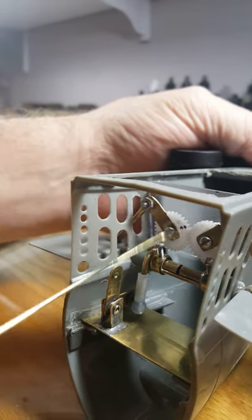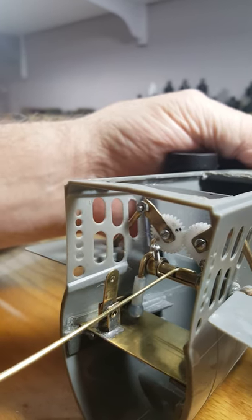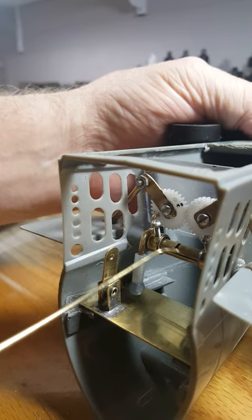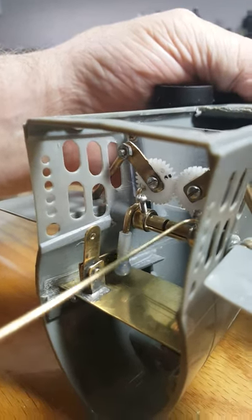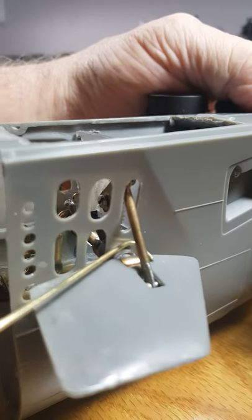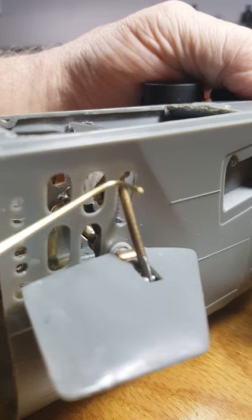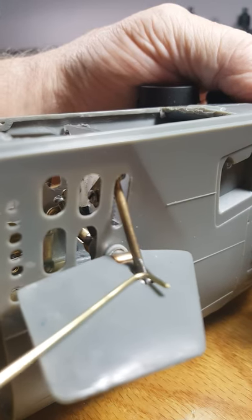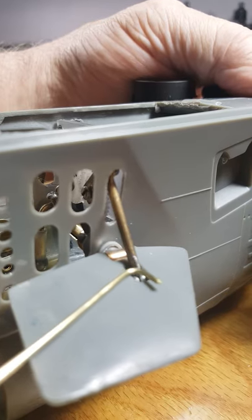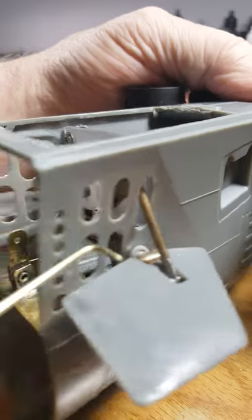I made this collar for the original plastic shaft to go through here so they have room to snap together. But I didn't like that, so I went ahead and made brass sleeves and hooked them up right here. This is nothing but brass tubing — it's flattened on both ends with a hole through it. There's a piece of number four finish nail right through here that fits just perfect and allows enough movement in the plane so it'll go up and down.